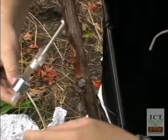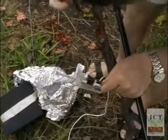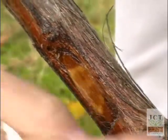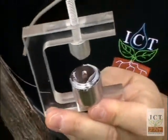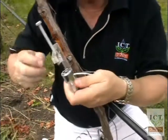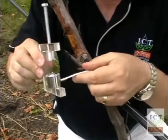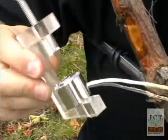You'll see we have some grease around the site. Use the excess grease that was initially sealing the psychrometer to cover up the wound site. Now that I've detached the psychrometer from that site, I'm ready to reinstall it, but first I have to clean off all the grease and clean the thermocouple well to make sure it's back in top working order before reinstalling it on another stem.